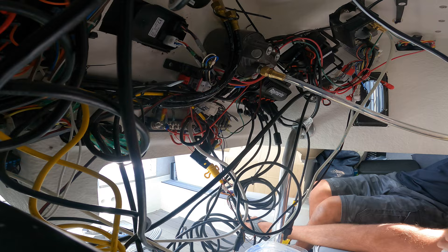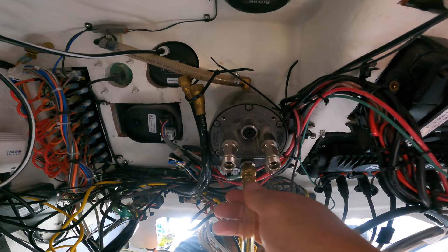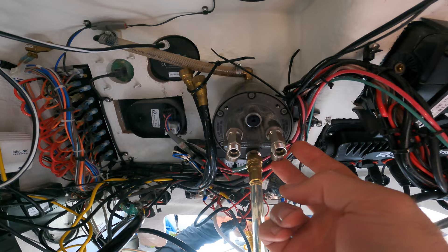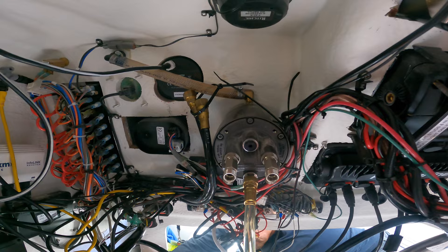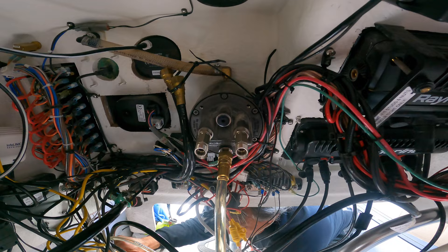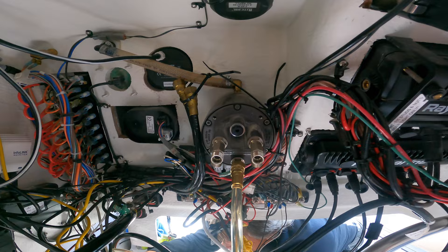I hate this - oil gets everywhere. Got the reservoir line hooked up here in the middle. Now we've got to hook up the actual drive lines and then the return lines to the pump. One thing to save you some time - it doesn't really matter if you go port or starboard, because on the setup wizard on the actual p70 you can switch it. So do your best guess going port or starboard, but once you hook it up you can choose the right direction in setup.